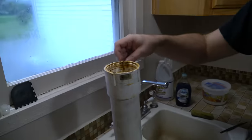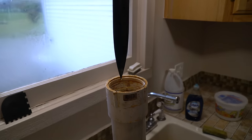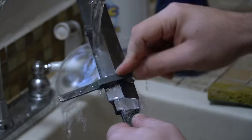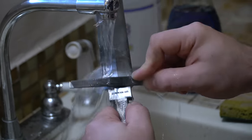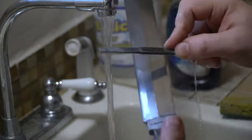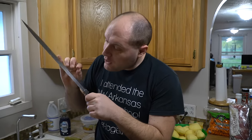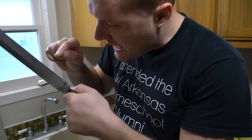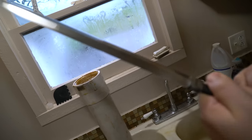This is going to be our first peek at the blade — it's been 60 seconds, we're ready to take it out and sand the oxides off. We've got all the oxides sanded off and now we can put it back in the ferric chloride solution. I've got a couple little spots here I'm concerned about that don't seem to be etching evenly so far, but hopefully they'll be okay as we progress.